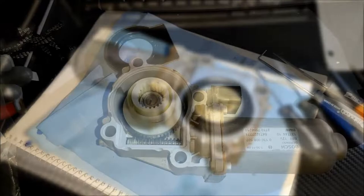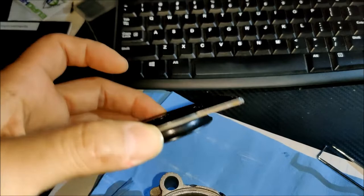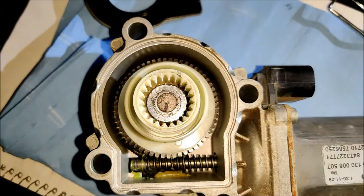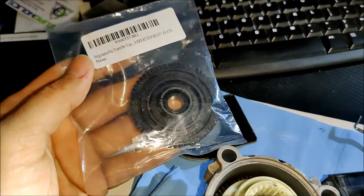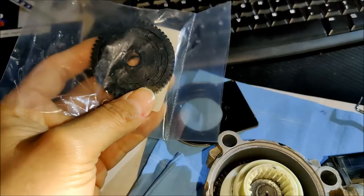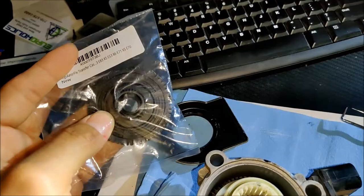Now that the plate is popped off — it didn't take me very long at all. Like I said, I had opened this one up a few days before to inspect the condition of the gear. I was going to just flip or rotate the gear 180 degrees as a lot of people do. I'll show you the condition of the gear once I remove that circlip. But I couldn't bring myself to do that. Here's a replacement gear — this was Amazon Primed, took two days to get here and cost nine dollars. So I couldn't bring myself to just flip the gear and put it back in when I could replace it for so cheaply. Supposedly these are CRP — carbon reinforced plastic or something. I don't know how legitimate that is for nine dollars, but I've used these before on other actuators and never had a problem, so I'm going to do the same thing on this one while I have it out.